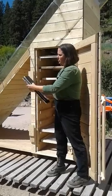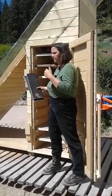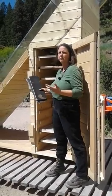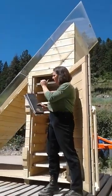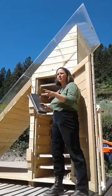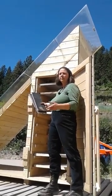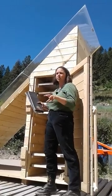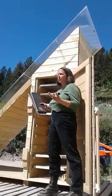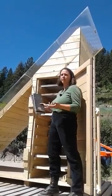This is a recipe that I wanted to try out that I've used in my house on interior finishes. That's a milk paint that's a lot easier to make. And I did a borax water on this one because I wanted to make a black with no lime in it. Either way, you're using an alkali to set the casein into a paint base. So we use 1 cup of borax water, which is where you put like half a cup of borax in a couple of cups of water and stir it up, and when there's still solids on the bottom, you know it's saturated. Like the borax, as much as you can possibly dissolve in the water has dissolved. You can do it with warm water, get a little more. You leave the solids, but the water is what you use that's saturated with borax. Cup of that, cup of yogurt, a cup or 2 of the pigment. In this case it was an activated charcoal powder we used as a pigment.